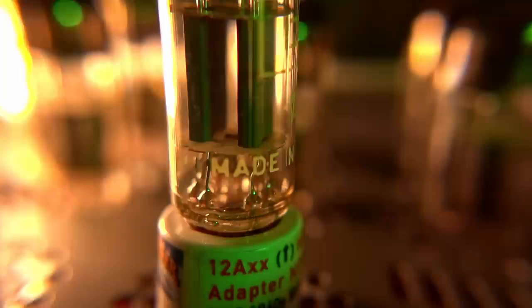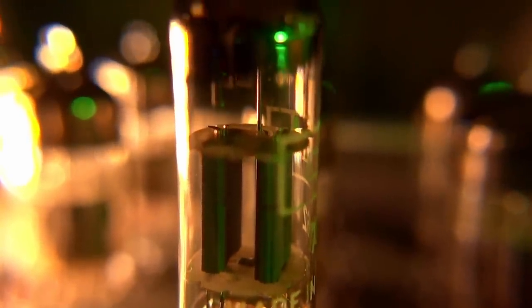In the input sockets the 7062s have some value but also some drawbacks. In the output stage their higher output impedance started to mess with the tonality of headphones and I wasn't always a fan. Ultimately I decided to focus tube rolling only on the preamp stage — partly because you need eight different tubes for the back which gets very expensive, and partly because I didn't want to raise the output impedance further. For all this tube rolling testing I used the consistent reference track 'Cliché' by James Vincent McMorrow.